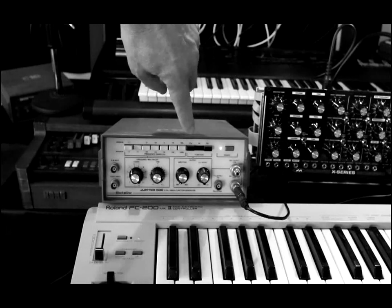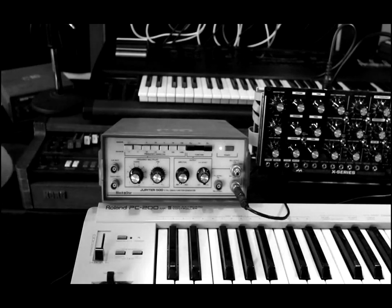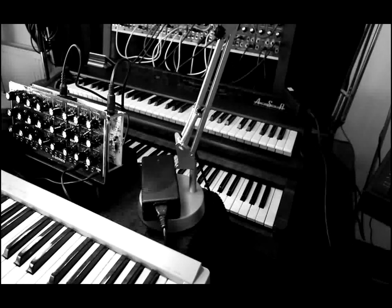This unit features a sine wave, a triangular wave, and a square wave. I'm going to be having this hooked up to the micromac so we can see what external modulations might sound like. The small box here, this is the power supply unit. This is a 50 watt plus or minus 12 volt power supply capable of delivering up to 3 amps on the positive rail. It's a very powerful supply, but it makes the synthesizer extremely stable.